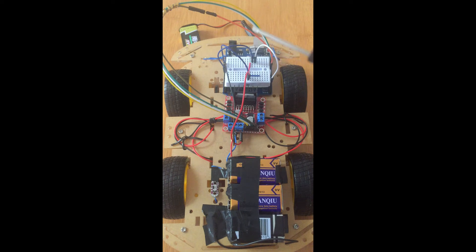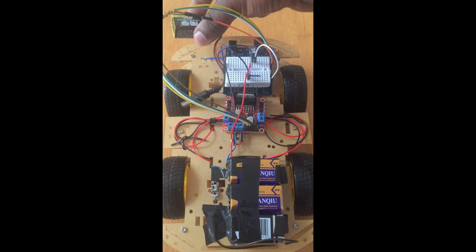The major problem with this setup is the power supply. What I've done here is use three nine-volt batteries to provide 27 volts, because I'm assuming each of the motors driving the wheels consumes about 5 volts. So the minimum I can have is 20 volts — I'm providing 27 so I can supply enough energy to drive my wheels for a good amount of time. The Arduino board should also have its own power supply, so I'm using an extra nine-volt battery for that.